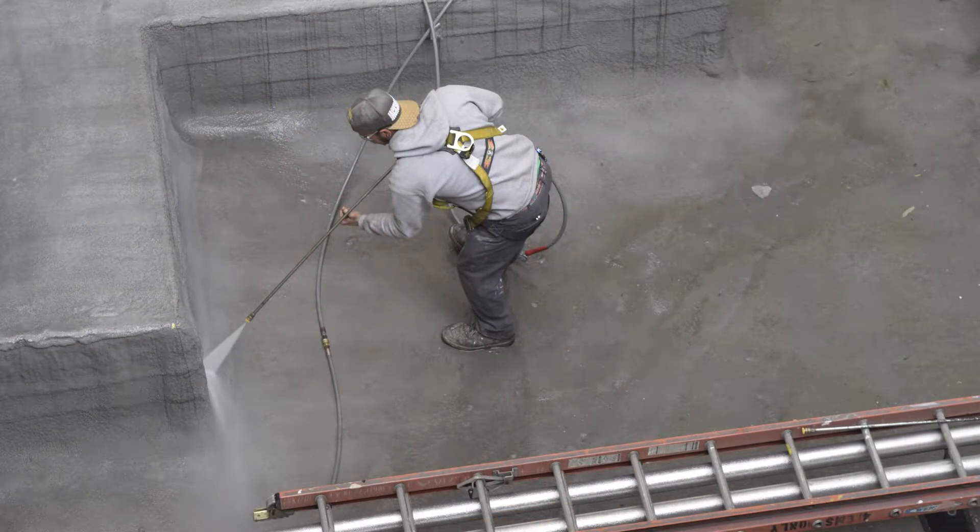The level of cleanliness matters. One of our owners has stated the roof should be so clean that even if you drop your sandwich on it, you wouldn't mind picking it up and eating it — that's how clean these roofs have to be. And then sound: we're talking about a roof being fully adhered. Foam goes over whatever's already there, so it's relying on what's already there for the system to stay on and not blow away. If you have a rubber roof that's only attached at the seams, we'll have to put a cover board over that to make sure it's fully adhered. Metals and granulated modified roofs that are already fully adhered — you can just spray foam over those. Sound just means that what we spray onto has to be fully adhered for it to work right.